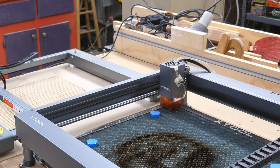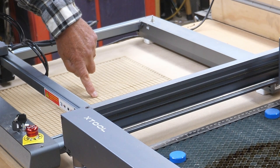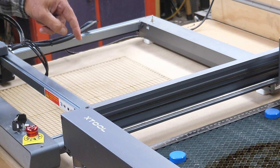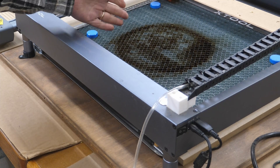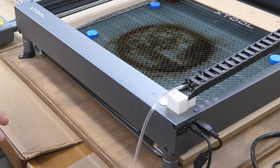When you have limit switches, you can work from absolute coordinates. I use LightBurn most of the time - I set a project up to work from center. I can center my work on here and center my work in LightBurn. This laser could be sitting at home position; I hit frame on the computer and it'll frame exactly around where it's supposed to be - I have my piece set in the center and it just works. With the X-Tool, I'll work from current position: I'll set my laser to the center of the work using a little mark, set the beam there, and work off of it that way.